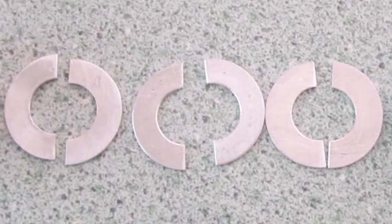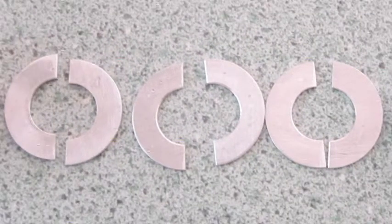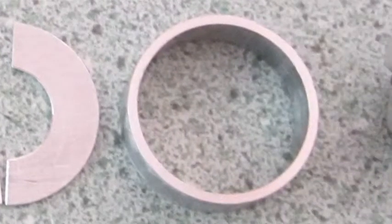They are split so they can be removed. They were cut on the guillotine so there would be zero gap at the split. Each half is punch marked so pairs can be easily fitted. The thicknesses make up the width of the neck. The tube, which also matches the bottom die ID, is used to hold the split washers in place.